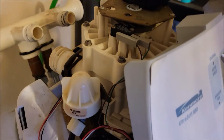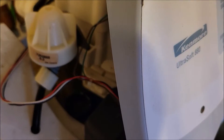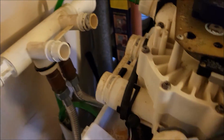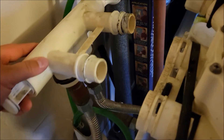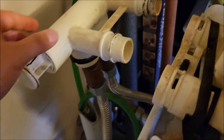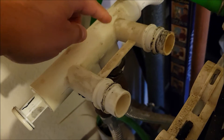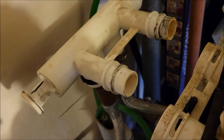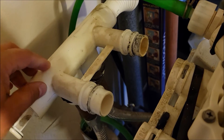So I pulled the top of our water softener off — it just snaps on, very easy to take off on most of these. I took off the clips for this bypass valve. This bypass valve goes into the back of the head of most of these water softeners. There are two black clips on this one. Our water is still on in the house because we have this in bypass, which makes the water just go back into the loop and not go to the water softener at all. If we pulled this valve out, water would just start squirting out of these tubes.